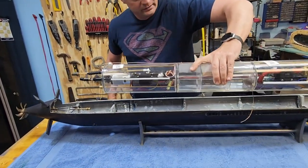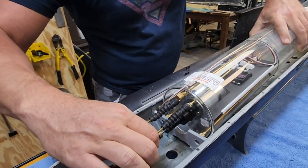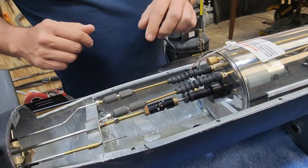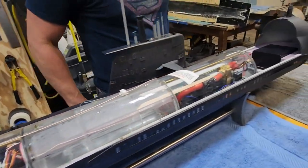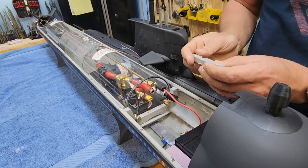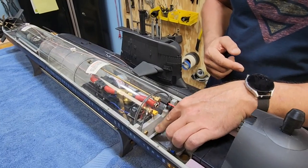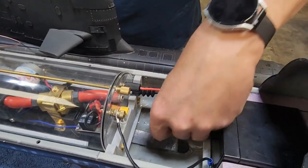Let's get everything installed — it is a very simple process. We're going to take our cylinder and we've got these knurled nuts that go into these holes. As you slip it forward, you take the spline shaft and line it up with your universal joint there. Once you do, just push everything back — that locks in and the magnetic connections lock in. Everything is done at the back. Up at the front we've got a little hold-down saddle for those same knurled nuts. We take our hold-down block, slip it over, grab a wrench and tighten down that bolt — and that locks this down.